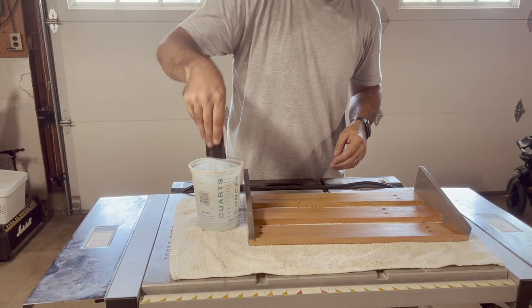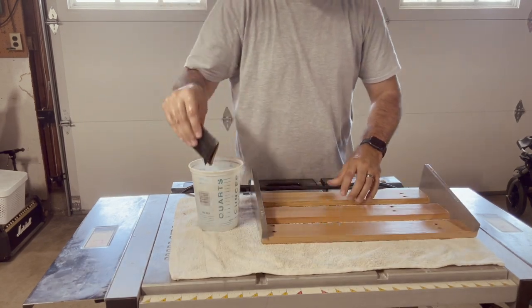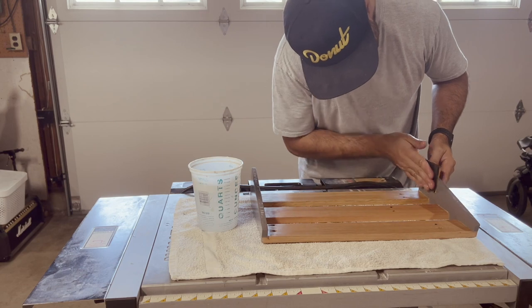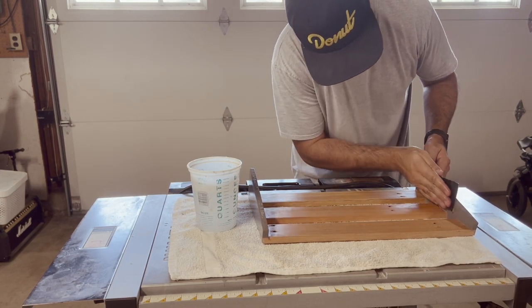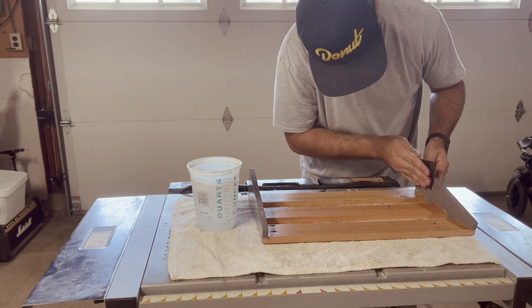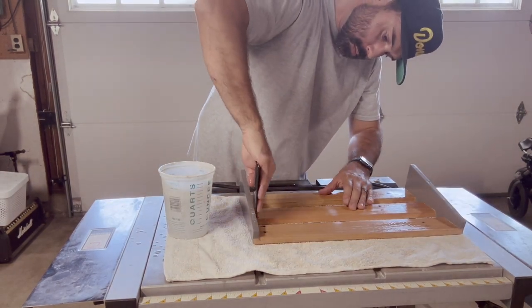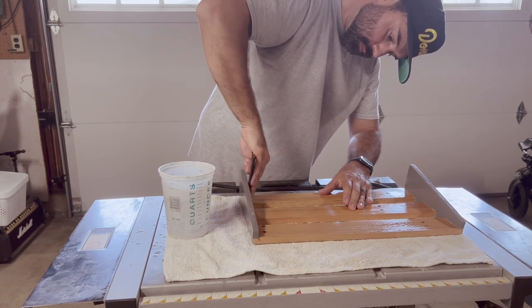Nah, you thought we were done. Don't worry, almost there. Here I'm just lightly wet sanding with 800 grit sandpaper and then stepping up to 1000 grit. Being careful not to remove any finish, just trying to make it smooth and not sand through it. This is a week after I applied the finish, by the way, so it's already dry and hard. Just like I like it.